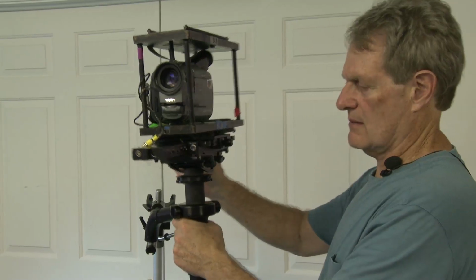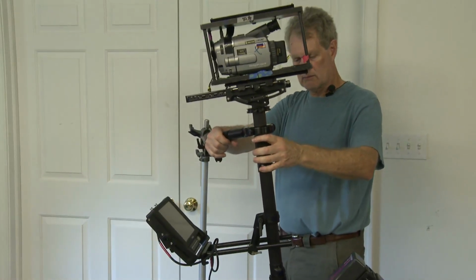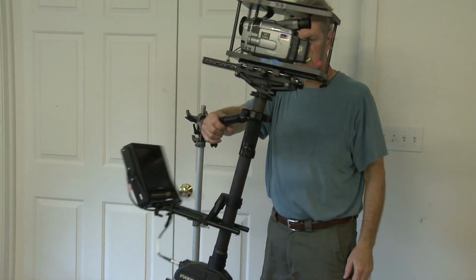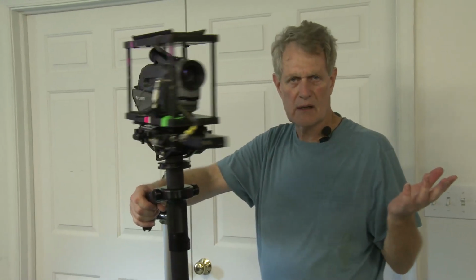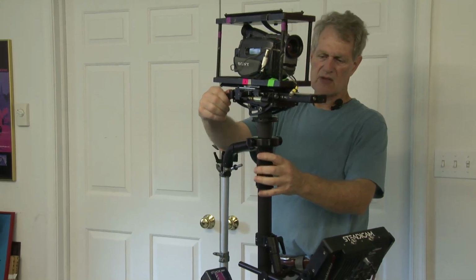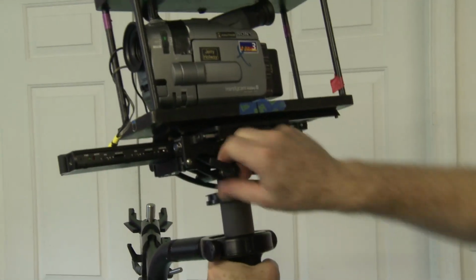If I trim now for headroom, let's say I was trimming for headroom, which is a very typical thing we've done. So I've just spent a minute or so trimming, and now I spin balance. Watch what happens. The whole thing goes wacky. So I've just wasted a lot of time if I'm trimming, right? What you should do is get it into a nice state of dynamic balance so the post is perfectly vertical, right?